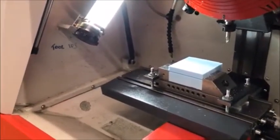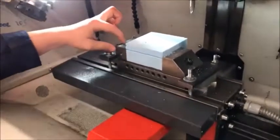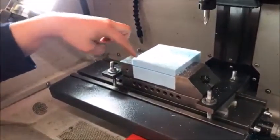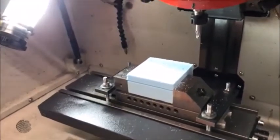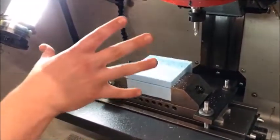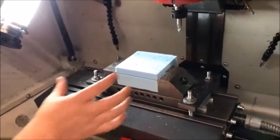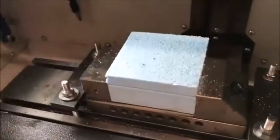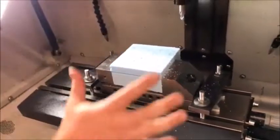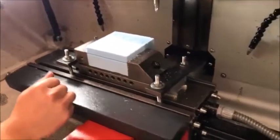The zero point for this device is the front left-hand piece on the top layer. It's really important to understand where you're going to be putting your part before you even do your CAD/CAM. If your jigging piece was flush with that edge, you probably wouldn't put that at your datum — you might go to the other back end instead. So it's important to set all of this up first and then go to your software to start configuring.